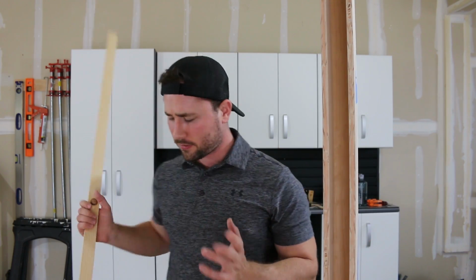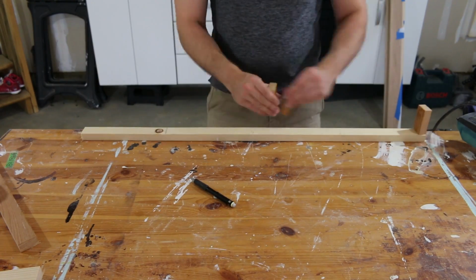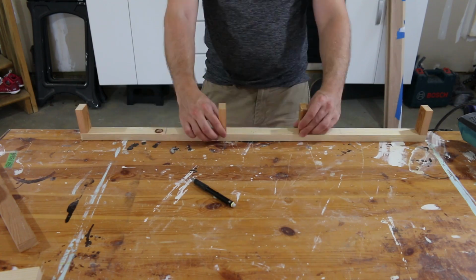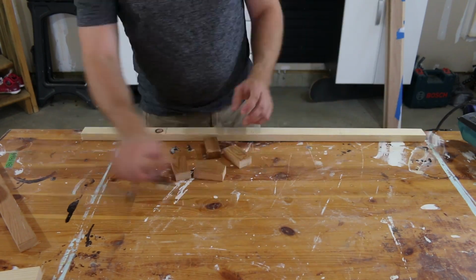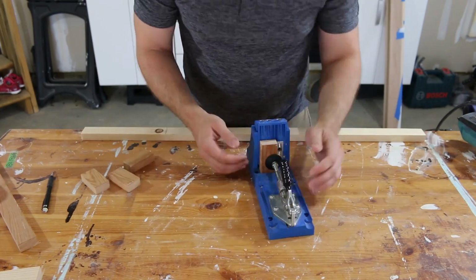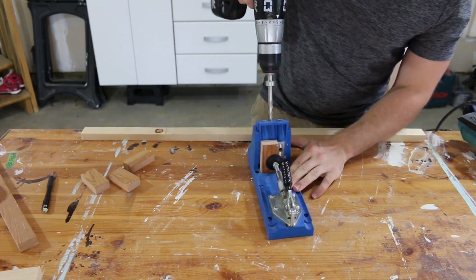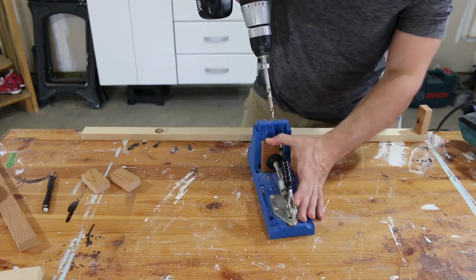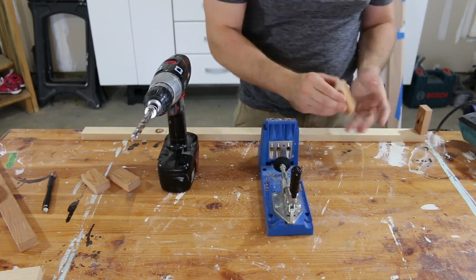And then we're gonna cut a few pieces so that we can reach the end of the inside. Why don't I just show you? I cut 4 1x2s at 2 5/8 of an inch and 1 long piece at 35.5 inches. This is what we're going to use as our bracket. Ideally, we want to evenly distribute the 1x2 support pieces so that it bears the weight of the shelf.